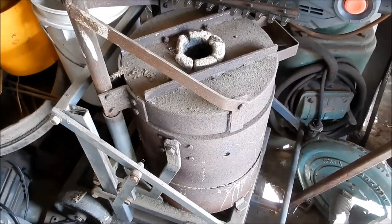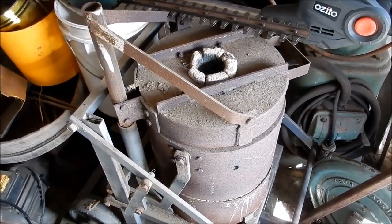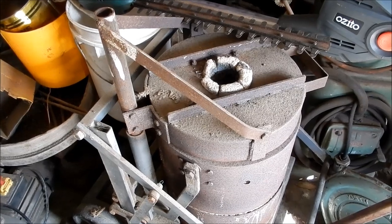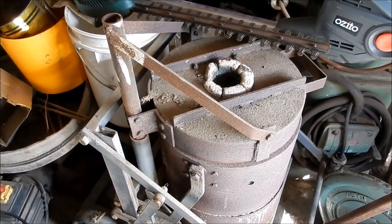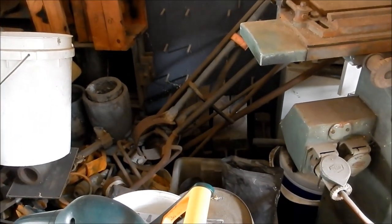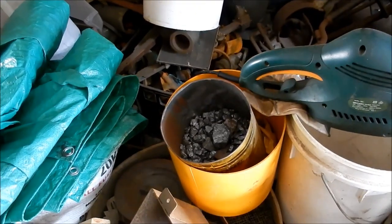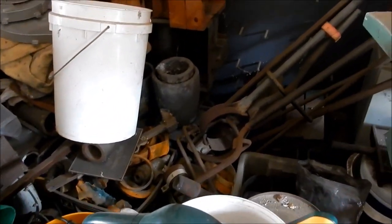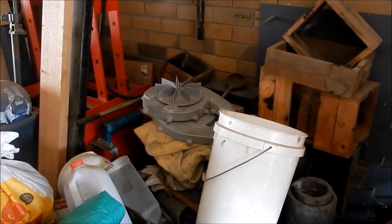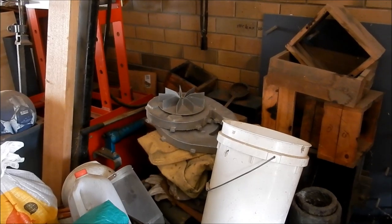This is one of our small furnaces that we ran — that's one I took home. The bigger furnaces obviously couldn't use in a backyard. I think the last time we actually melted the crucible out and ended up blocking it with a load of aluminium, so a bit of cleaning out and refurb to do on that one. I've got some crucibles, lots of flasks, lots of scrap bronze, and some silicon that we used to crush up and add into our iron. There's a fan casting — if you don't think you can cast very thin in aluminium, those fins are about a millimetre thick. You've got to have your aluminium absolutely perfect to do something like that.